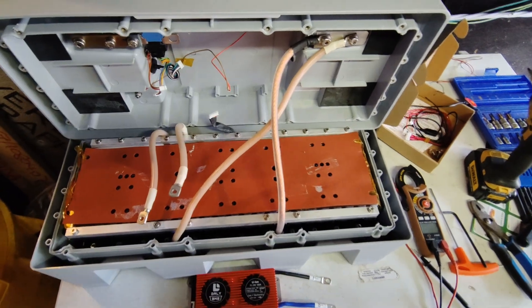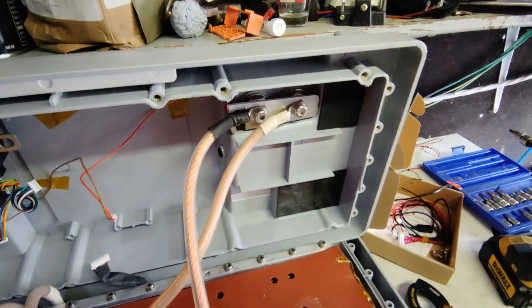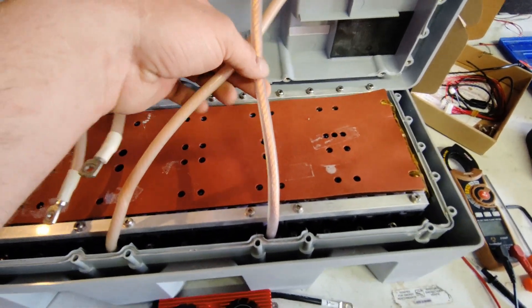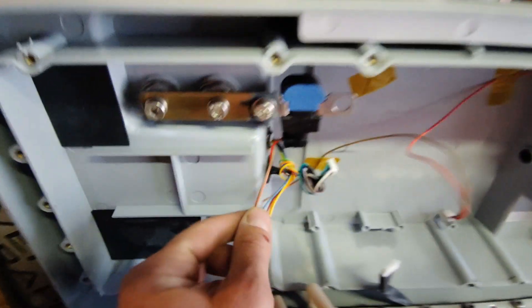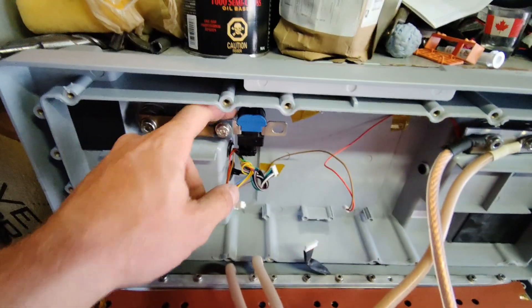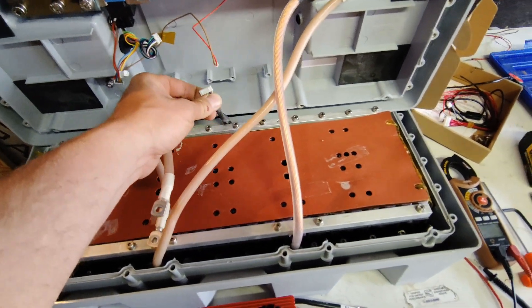So what we've done so far: we removed the original BMS and cut a piece off it that was bolted on with a large section I didn't need, just to bridge the two terminals. These are the two positive terminals and these are the two negative terminals from the battery. They're going to go together and connect to the DALY BMS battery negative. The P-negative is going to go up to the bus bar. I'm also bypassing the switch — or possibly current meter — that was there, and the DALY BMS will serve as my on/off, rated for 100 amps.